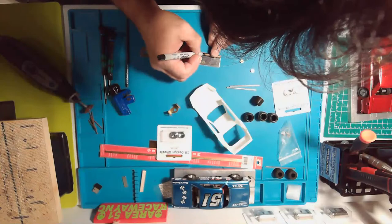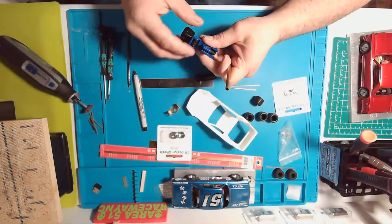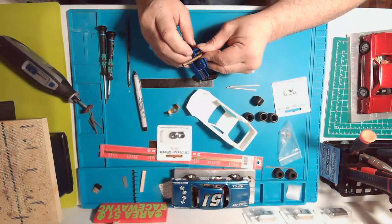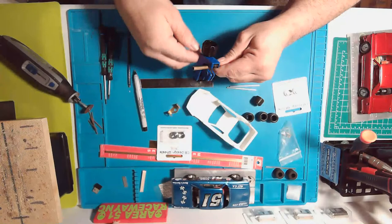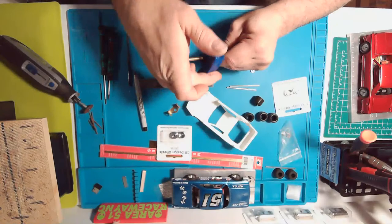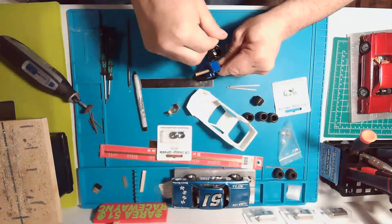I'm going to grab my tubing cutter and cut the tube. I'm going to put it right where the blade is going to go. This isn't a super high def 4K camera, but it's a high definition camera, so I hope you can see what I'm seeing. You want it on the line there, then you squeeze this a little and turn it as it gets loose. Tighten it up again, and tighten some more. You just keep going until it will pop and break. It's really easy to cut these brass pieces with this tubing cutter.